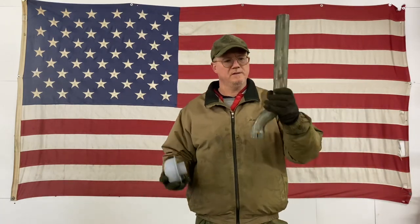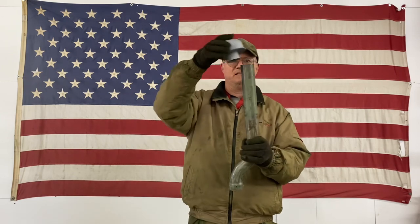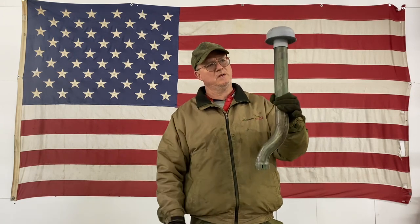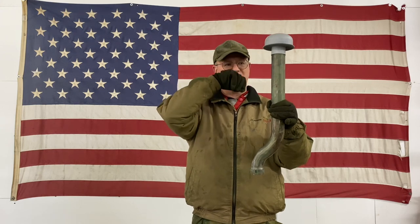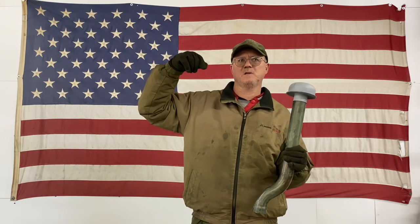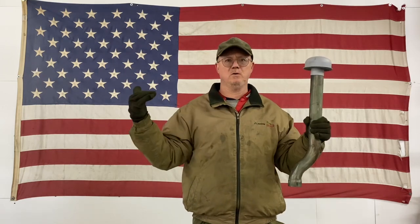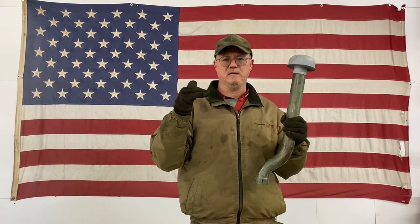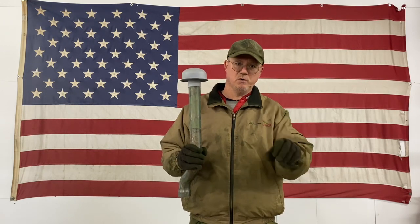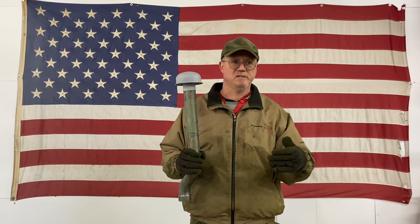This is my air intake stack. Normally it goes to the tractor — you can see where the old rubber grommet was. I'm eliminating my exhaust stack because I'm going to use the tractor occasionally to go into the woods and pull logs out. There are going to be low-lying limbs, and the exhaust stack would continually hit them and cause a lot of damage. So I've eliminated the exhaust stack going above the hood — mine's going to go at a 45-degree angle.